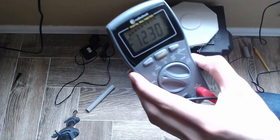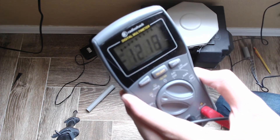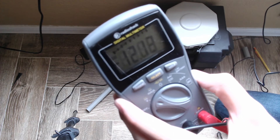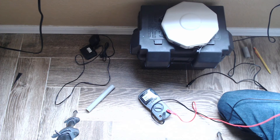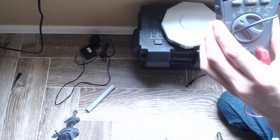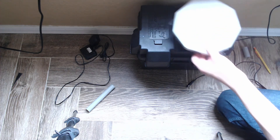In indirect sunlight, mounted at a bad location with a bunch of clouds in the sky, the 1.5 watt panel is producing around 12 volts, though it is fluctuating. The 15 watt panel — which is actually 10 times the size of the other panel — is outside at an angle and is producing about 20 volts. So I'm going to put them into the system.